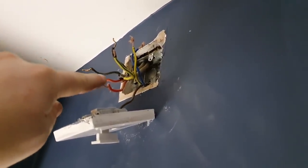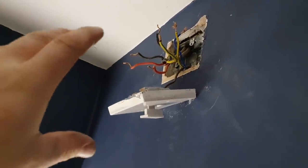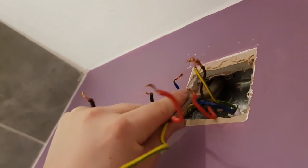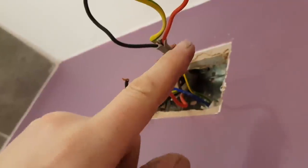So this is the last — the penultimate accessory on this side of the ring, and then it goes across to that socket up there and back again. In the ladies we find a similar thing, and this is directly below the one that's got the erroneous reading on the neutral cable — the black in this case. But look, these aren't the same cables, this is a new cable. There has to be a junction box in the floor space or ceiling space somewhere.